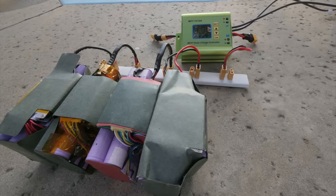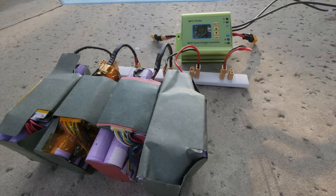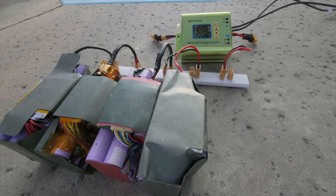It all started with the hoverboard batteries. If you were around at that time, you might remember that about 75,000 of these became available through Tom. I got a few samples early on and was testing them — checking if I could parallel them, charge them fast, discharge them fast, and they all passed. You can do about 5 to 10 amps continuous on each one of these packs.